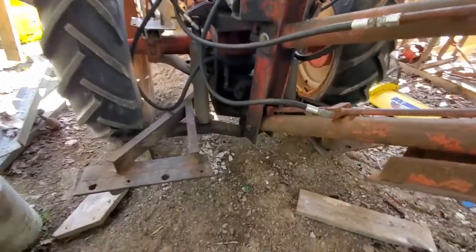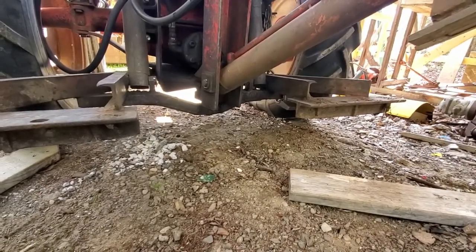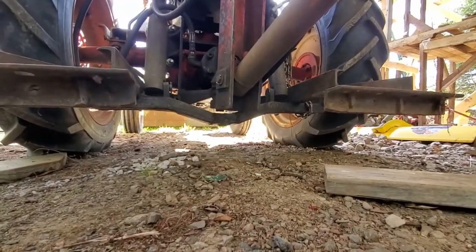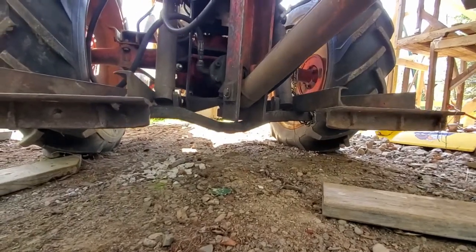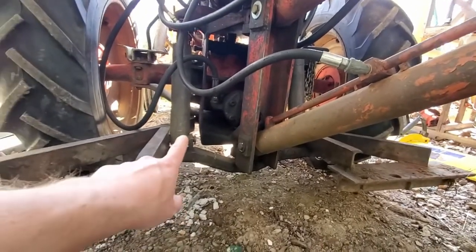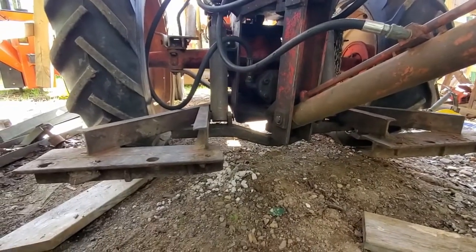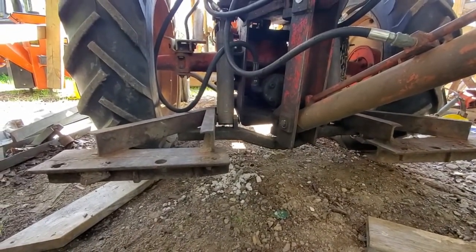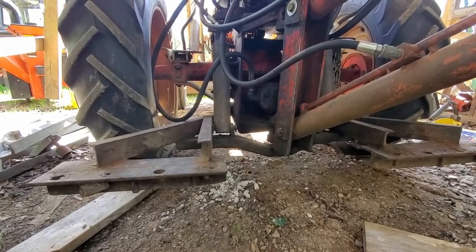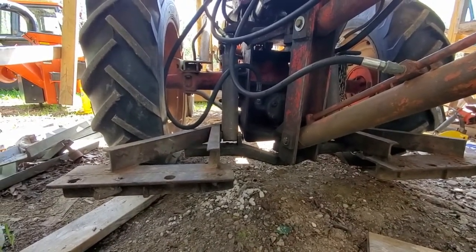These stabilizer arms are one welded piece that's joined by that U-shaped cradle. Right under there. These are pushed down by one-way rams, as you can see here and over there. What brings it back up is the three-point lift mechanism, and it's a bit of a coordinated effort to bring the three-point lift up while you're relaxing the pressure in the valve bank so that you're not fighting hydraulic forces with the tractor itself.